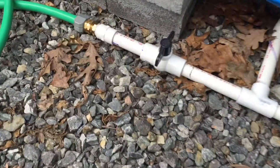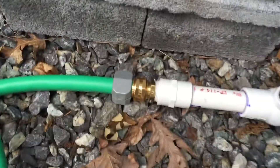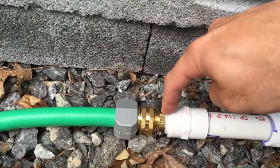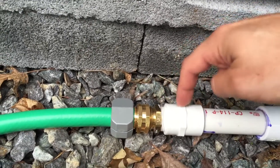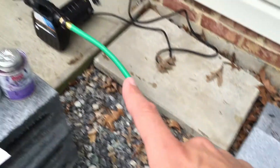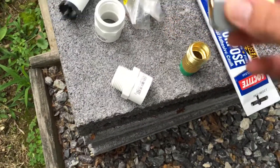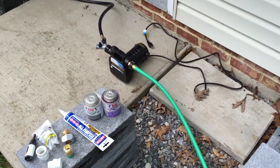At this end I've got a 3/4-inch ball valve, and I made a hose connector. This piece right here is just a male connector — this side is garden hose thread, and this side is PVC thread, because it fits perfectly into this female union here, with glue on this side and threaded on this side. The hose I had to make, because it's got female on this end and female on the pump end. I just bought one of these hose kits from Lowe's, cut the end off of the hose, and put that on there. That allows me to hook up the pump.